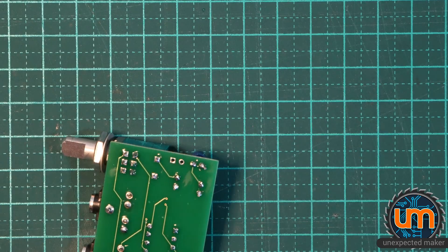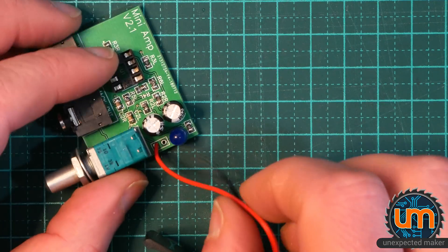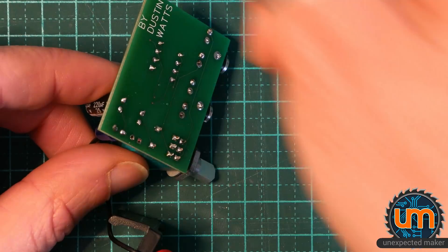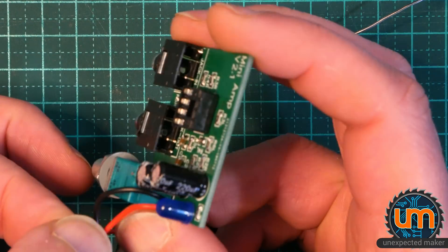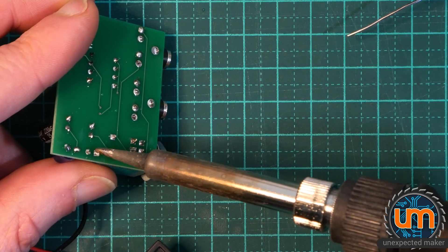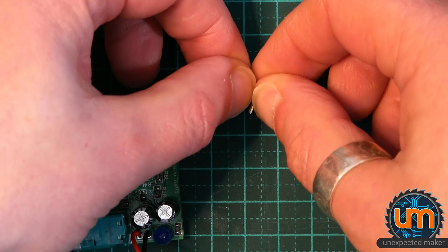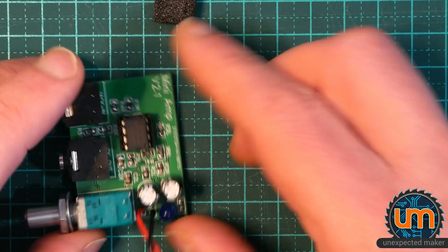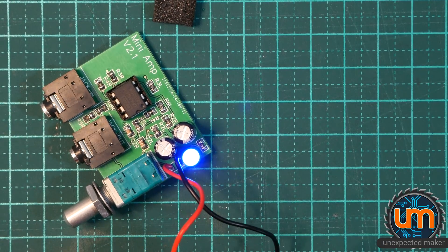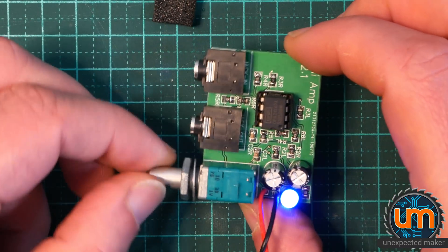I'm not going to put the chip in yet — I'm going to connect power first and see if I've got a 9-volt battery. Wow, look at that — unopened! Positive and negative: negative is that side, this is negative, and this is positive. I'm going to do the one-handed soldering trick — someone get ready to call an emergency. That is our power connected. Let's put the chip in — make sure we put it the right way. Might need to fold the legs in a little bit. Never push until you've checked the pins. Looks good. And we're in. LED turns on — I think that's a good sign, right? I've got the polarity right. There is a switch. So it's a volume control.